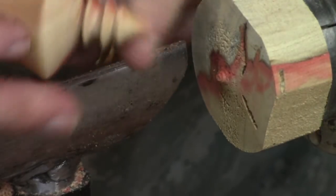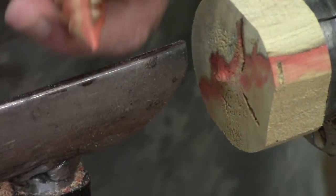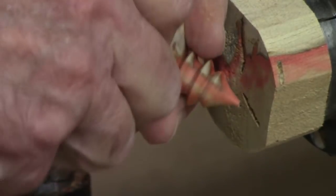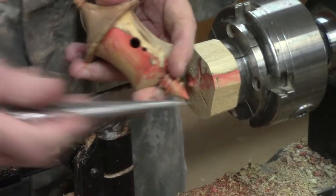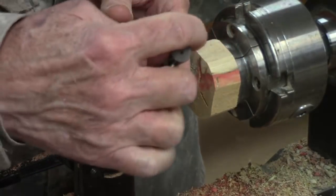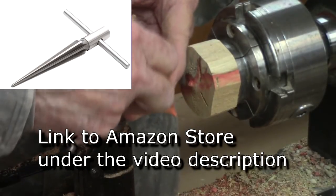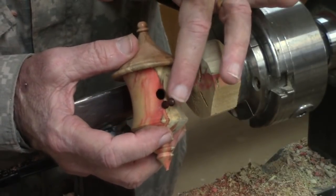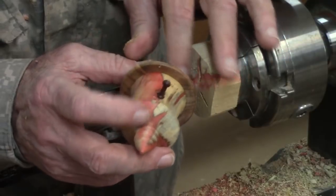I've torn out a few fibers but nothing that can't be dealt with with sandpaper. I like this shape. I've already turned a little perch — every year it gets harder to bend over! Details really matter on these small projects where people are going to hold it up and look at it. As I put this perch in, it's clear that it's too snug, so I'm going to use this little plumber's reamer — I've got these on my Amazon store. These are great for making this kind of joinery and getting these holes to fit better. It goes down to an eighth of an inch, and then the perch fits in much nicer with a little CA glue. Details matter: turning a perch is much better than using a bamboo skewer. Adding a little texture is a nice feature — coves, curves, no flats.